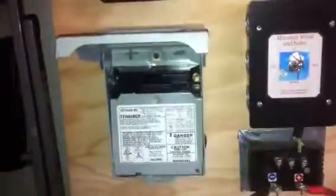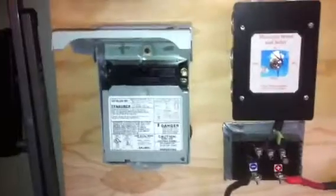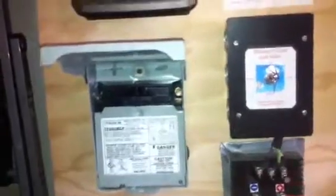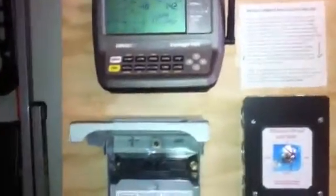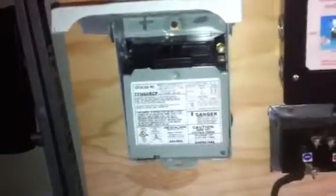The purpose of the disconnect is that if you want to work on your equipment, you've got to pull this and disconnect your load so you don't electrocute yourself — it's a safety situation. You should also have one of these disconnect boxes accessible on the outside of your house for utility workers. If they're working on the lines, they need the ability to disconnect your system so you're not feeding the grid while they're working on it. Even if you have an island-protected grid-tie inverter, you should still have one, and it's required by code.